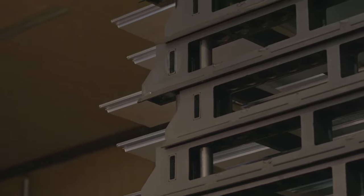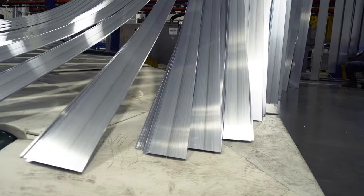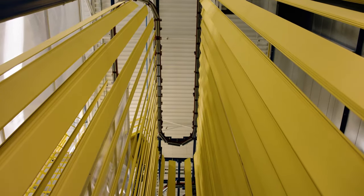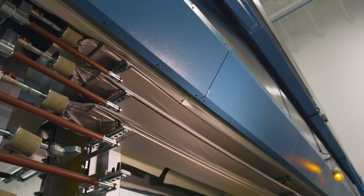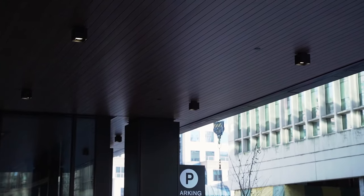We take that piece of aluminum and run it through our vertical powder coating line, applying a base powder coat. Then we go to the final decorating process, where we tattoo ink into the powder coat finish. The ink goes through the full depth of the powder, so it's afforded all of the UV stability designed into the base powder. When we come out of that process, you have this amazing-looking piece of wood grain aluminum.